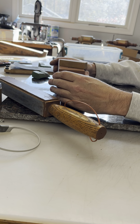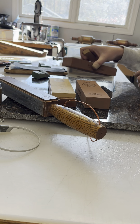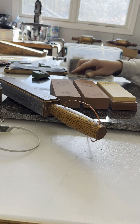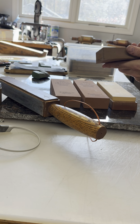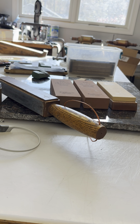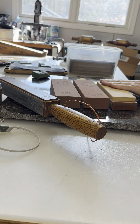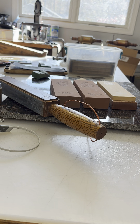You can get diamond stones — that would be one solution. This is a brand new set of three water stones from the King Corporation. These are Japanese water stones. Here is my used bin over here. I keep these all separate. These are dished out because I have sharpened them for convexing. So I have a set of convex ones, and then I have set these aside for Scandinavian grinds and things like that for an absolute flat surface. 800 grit, 1200 grit, 4000 grit. The grits are different in the Japanese stones than they are for sandpaper, so don't treat those the same. But if you get these three, you can sharpen almost any knife out there.